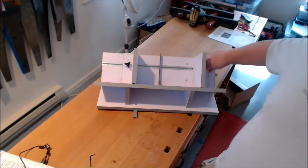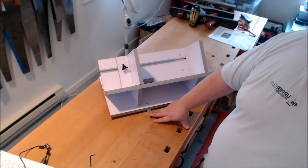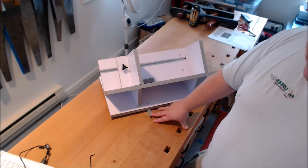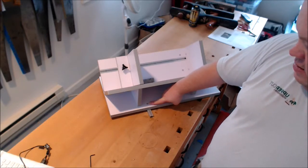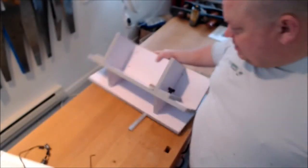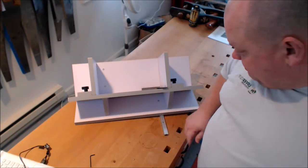Those have a little bit of variability in them, but when you tighten it, if you just push it down here and tighten it, then it's basically dead on. It's got this adjustable miter bar. The downside is you can't adjust it once it's on the rig unless you take it off the rig, and taking it off the rig requires removing screws that are kind of underneath this tray. And so that'd be a pain to get to, especially this one that's way up on here.